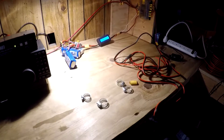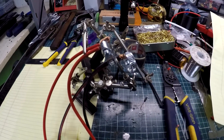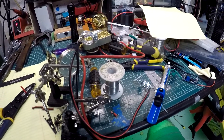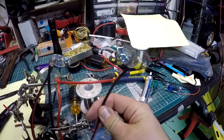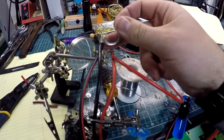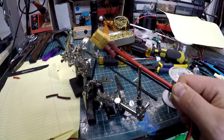I have a diagram of half of what I'm doing so I don't mess it up. I'm just gonna make a little jumper that will go down to the batteries and then jump to the other battery. Let's go inside and make that where I have the high-powered soldering iron. I got the wire stripped and I got it around the first connection - this is going to junction into the first battery and then jump over to the other battery. So I got my battery lead side hooked up with the hose clamps. This is my junction - it goes to the first battery, then I have the jumper for the ground lead. I have a similar thing over here for positive. Now I just need to put an XT-60 on the other side and now we got an XT-60 on the other end, so now we go back to the shack and hook it up.